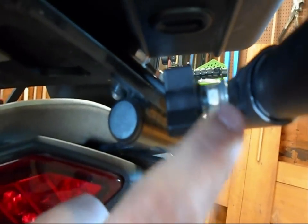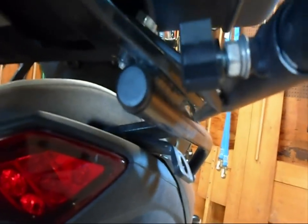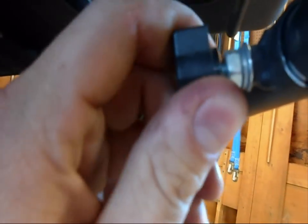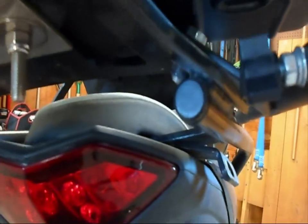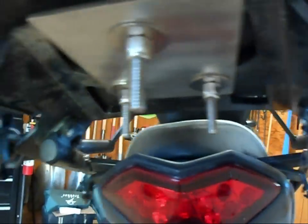On the back here, I've got a quarter-inch nut welded on. If you're doing this on a metric bike, try and use all metric parts — that's kind of a hindsight thing on my part. I've got quarter-inch thumb screws I thought would be neat, but they don't stay in by themselves, which is why I've got the lock nut assembly there. And I've just got neoprene stoppers that I pounded into the end of the tube and cut off flush. I only had three, but you could get plastic caps like the rack has, which would look really nice.